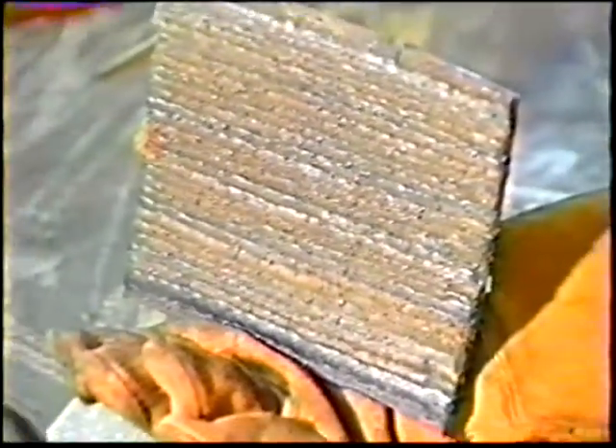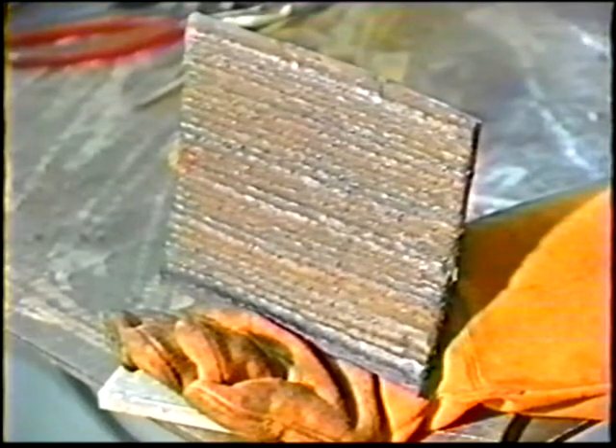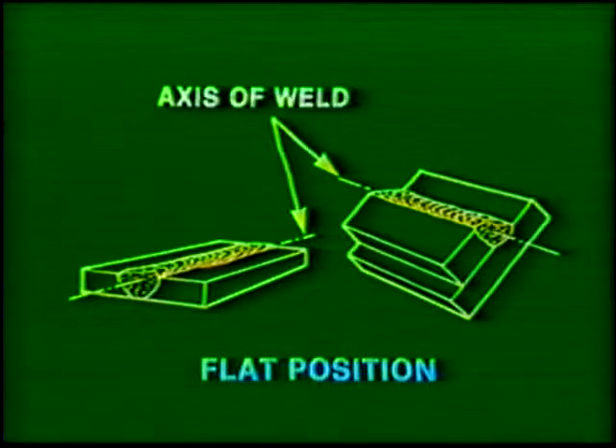The objective of this topic is to control bead placement by covering a plate with overlapping beads and to properly fill the crater for smoothly finishing the beads at the ends. Flat position welding is defined as welding performed from the upper side of the joint with the face of the weld approximately horizontal.